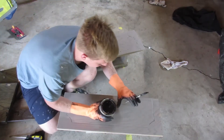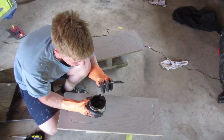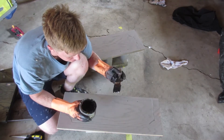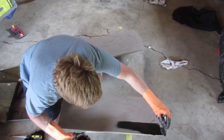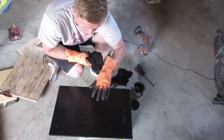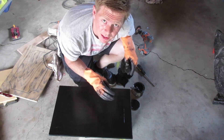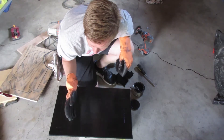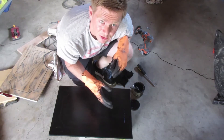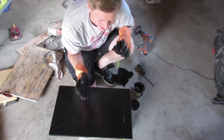Now that everything is ready for stain, I actually went back and did a second coat of gray because I want it to stand out more. Here's the stain - this is a gel stain, so it's not like your typical wet rag stain. I use a paintbrush to apply it. Something happened to my audio when I was filming the stain removal, so I'm redoing it now on some extra drawers. Once you put the stain on, depending on how dark you want it, you can let it sit or take it right off. You can even dip your rag in a little bit of paint thinner for a lighter color, or leave it on longer for darker.